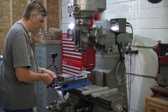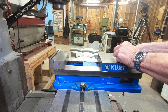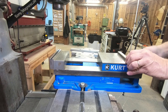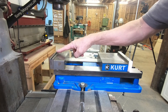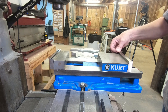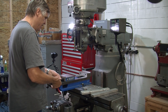One thing you can do that gives you a little bit more room is if you turn the jaw over, it'll actually mount up a little bit higher. This particular jaw will now sit quite a bit higher. Because it's not sitting down on the vise floor itself, this surface up here is not going to be precisely aligned, so don't use that for alignment. You can maybe put as much as a quarter inch spacer to get up where you could perhaps drill safely, but be careful. The best thing to do perhaps would be to make some soft jaws.